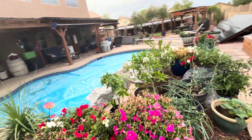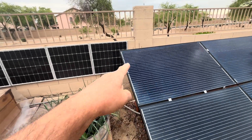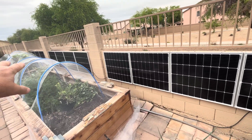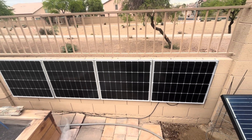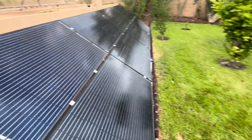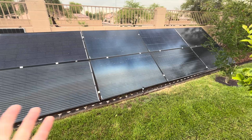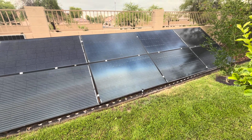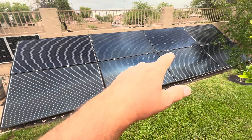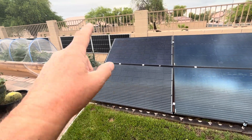You can see how close the solar array is to the wall, but the sun is actually high enough that this solar panel does not shade that one at all, and the garden doesn't shade it either — these get full sun because the sun's at an angle. In the wintertime the sun would be lower and a lot of them would be shaded, so you're much better off doing a ground mount like this. I have eight solar panels on here and it cost about $150 at Home Depot for the pressure-treated 10-foot 2x4s, deck screws, and clamps. This has worked fantastic — so much better than on the back wall.